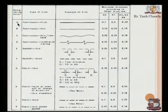So A is the designation, which designates continuous thick lines. This is the example of a thick line, whereas this shows that on a sheet of A0 it should be a minimum of 0.7 mm thick. So this tells me that if I want to draw a continuous thick line, I should use a pencil which has a minimum thickness of 0.7 mm. I can use a mechanical pencil with a lead thickness of 0.7, whereas on A1 I should use 0.5, and on A2, A3 or A4 it should be 0.35. The same goes for each and every line that we are going to discuss.